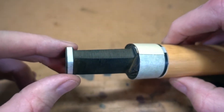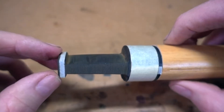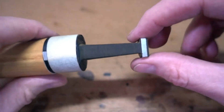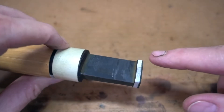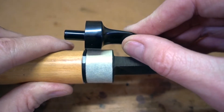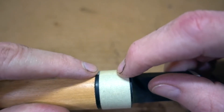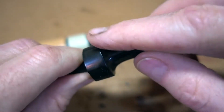I can't remember the last time I had to abandon a replacement stem — I always get what I'm shooting for because I'm methodical. That's why this all looks like a domino right now; it's almost an art piece, but we won't be anything close to that when we're done. Next step: keep the centerline going — we still have our slot. We'll cue off of that and run a thin tape line down each side, or even a pencil line at this point, and mark the zone we don't want to touch. There'll be a zone between my fingertips here, all the way around, that for the present time we don't want to mess with.